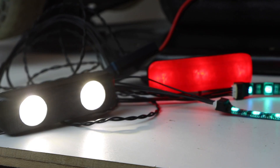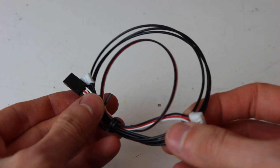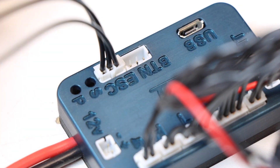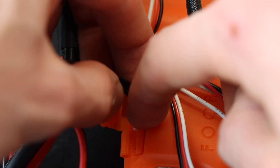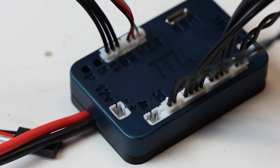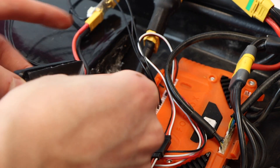The next set of wires connects the TTL module to the UART port on your VESC-based ESC for communication and data transfer. Plug the three-pin connector into the ESC port on your TTL module, then plug the opposing end into the UART port on your VESC. Because this uses the UART port, you can realistically only do this if you're using a PPM-based remote. The courtesy horn simply plugs into the two-pin port with the horn logo on the module.